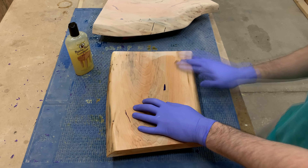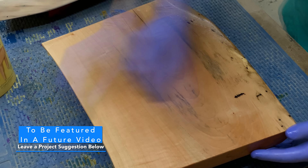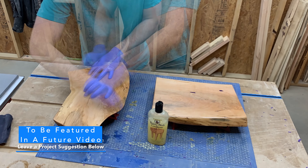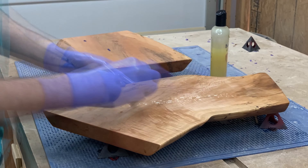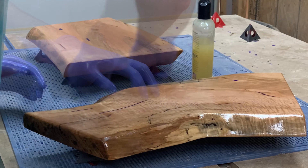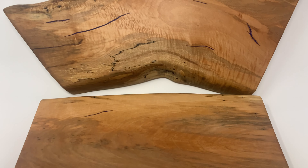With the rails cut I rolled the table saw back in place and then clamped the rails down to the workbench. We built this router sled in our herringbone pallet wood coffee table video, which I'll link in the description below. I set it on top of the rails - you can see how the sled will evenly ride over the slab. I threw a one-inch straight bit on my router and started making passes across the surface. You basically remove a little bit at a time until you have an even cut all the way across, then your surface is flat.